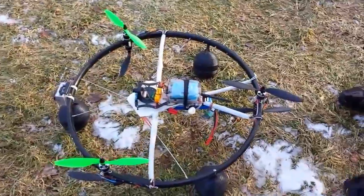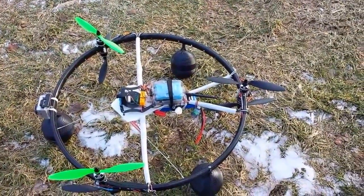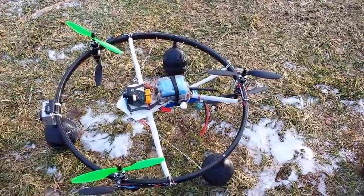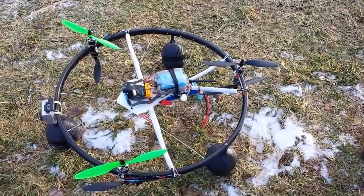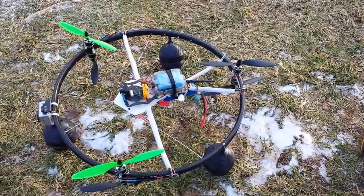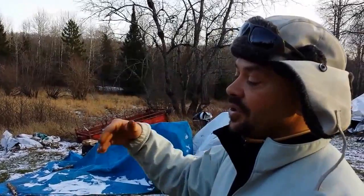Do you know what I mean? Like, if you have your 4G LTE card or whatever, that plugs into that, this is the key. The antenna. This little tiny thing is the 2.4 gig antenna, and what you're trying to do is connect between that and the ground. So you need, from the live stream broadcaster, an SMA external antenna output that you can interface your Wi-Fi with. Now, I'm assuming it has a Wi-Fi interface. So if you can have a circular polarized antenna on your ground station that's connecting your laptop's output.